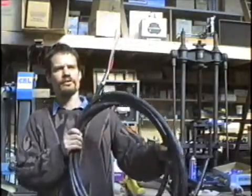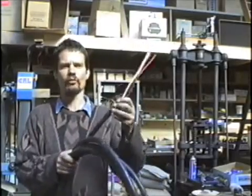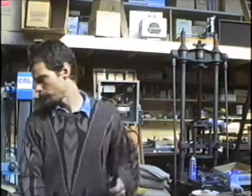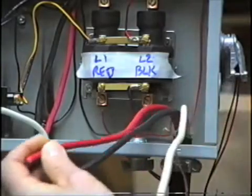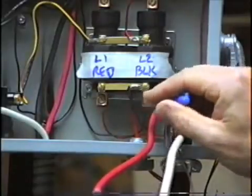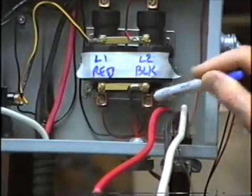I've got about 25 feet of this flexible number 8 wire and I've stripped about one foot on the end. Now I'm going to attach the red and the black wires to the red and black terminals on the supply side of the power relay.